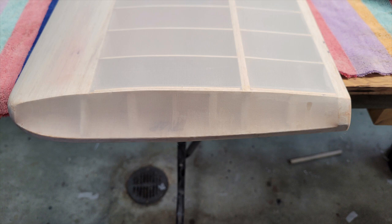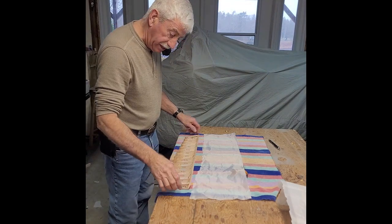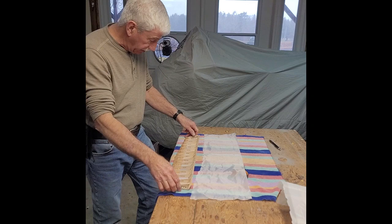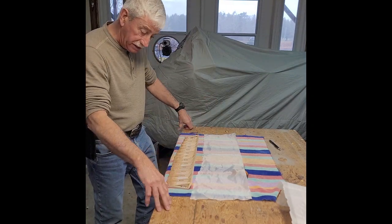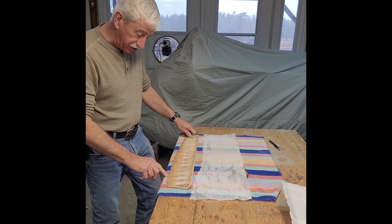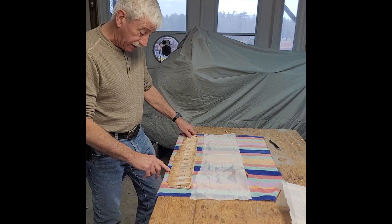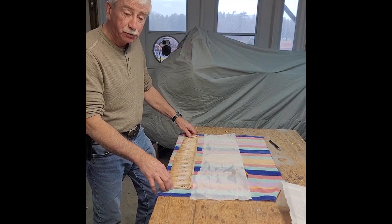The following is some video I took while covering the ailerons. Welcome back to the shop — today I'm covering the ailerons. I put the bottom of the aileron pre-covered already, just ready to put on the top to finish it off. These scalloped edges do make it a lot of extra work and take a little more time. Anyway, if you want to follow through, we'll see how this goes.